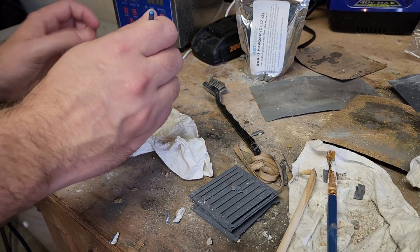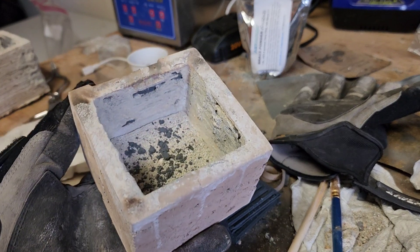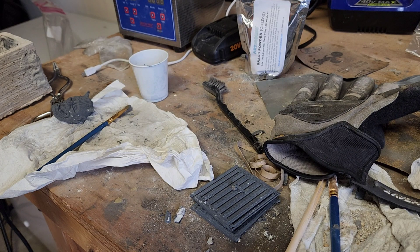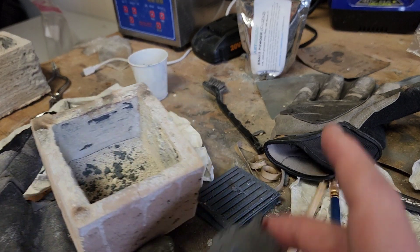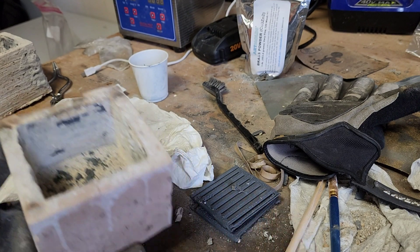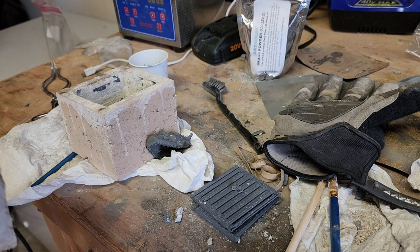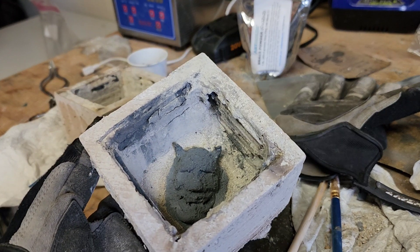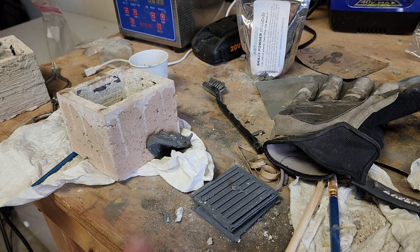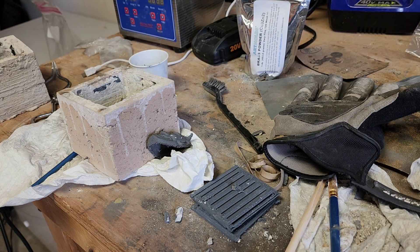At this point, I had a hunch that my zinc paste formed a contaminant in the refractory that caused better sinters. So this test, we'll be splitting out some of the additive into this crucible, putting a little more ballast on top, then resting the mask inside with a little ballast and a little more additive on top. The other test is pouring the additive directly on top of the mask. We'll be firing these to de-bind first, then running the same microwave sinter cycles to compare the differences between each process.